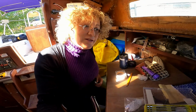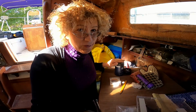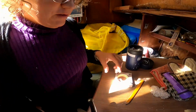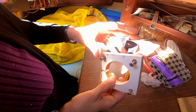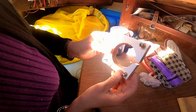We have some marine lights that we need to install in various parts of the boat, and the lights themselves mount flush, which means I need a way to back the wires. And since this is going up against an old installation, which is up against the ceiling, I had to build a small box here, basically as a raised surface, so the light will sit on here. The wires will run through here, but you won't see that once it's done.